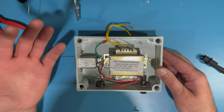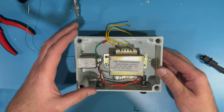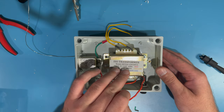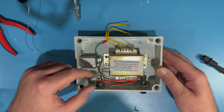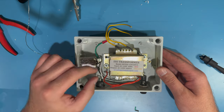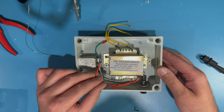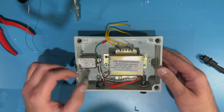I've temporarily mounted the isolation transformer into the junction box with just two bolts. We need to take one of the red leads from the isolation transformer — which are the input lines as indicated — and connect that to the other lug on the switch. The other red line going into the isolation transformer connects to the neutral on the power socket slash filter, as does the neutral line going to the switch. So two wires are soldered to that lug, and one red wire to the other.